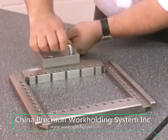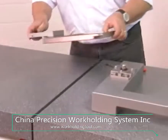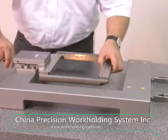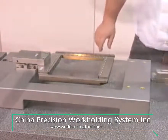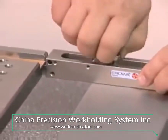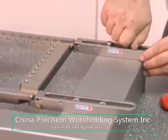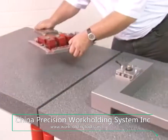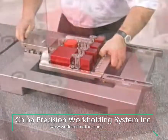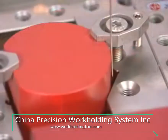The clamping frame is the optimal device for the multiple palletization of workpieces. To support workpieces of 15 to 30 kilograms, it's necessary to fit the Z-discs to the machine base. EDM wire threading recesses have been placed behind every workpiece.